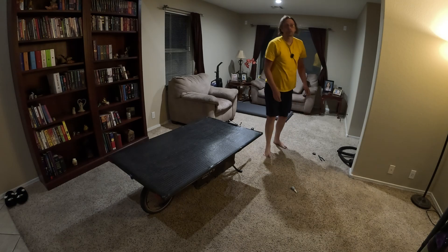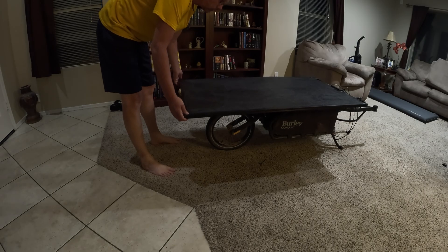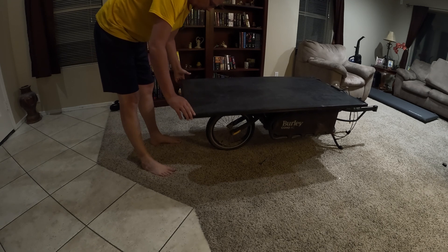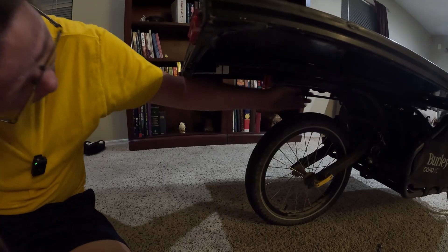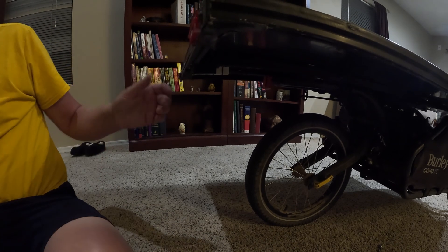All the wires are cleaned up and I've got the two rails secured on there. Now I'm going to put it on the solar trailer and see how everything fits. The mount there has basically three screw points — three ferrule points that match up — so I'll back the screws out first and then line it up. It definitely feels like it's stiffened up the back end. When I shake the left or right side of the wing, it takes the whole trailer with it.